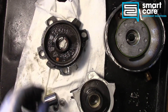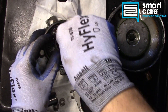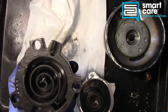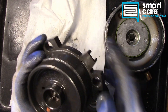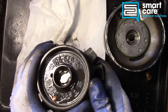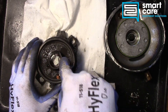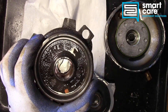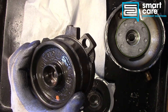Looking down in the center, the check valve is in there but there's also some kind of retainer — I don't think I'm going to be able to get that out. It looks like a spiral lock, a spring clip that goes around itself more than once and expands when put into a slot. I don't think I can get that out without completely destroying it.